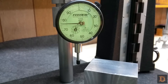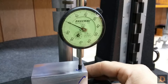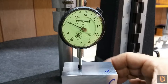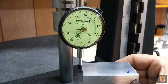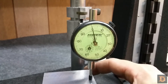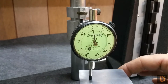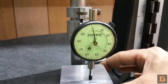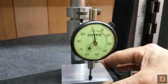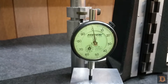We'll test the other sides. We've got you flipped over here. You did that with a mill — good work. Let's flip it over and test the tall side. Here we are on the other side. What does it look like there? It's half a thousandth — I think that's pretty good. We'll get about a thousandth that way. That's not too bad. Good job. Thank you.